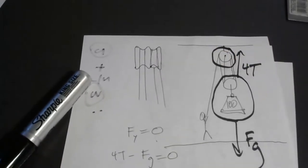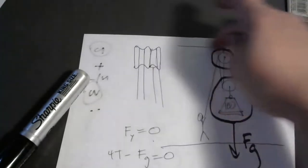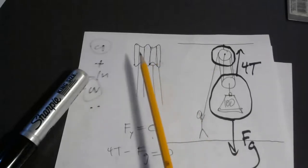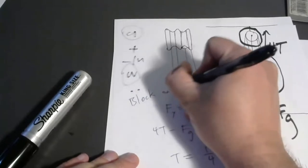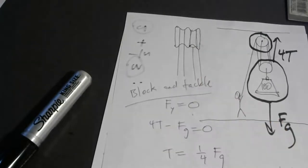If you just step back and take a bird's eye view of the whole problem — what's pulling down on the ceiling? There's the 100 pound gravitational force ultimately transmitted to the ceiling, but there's also you pulling down with an extra 25 pounds. So you can't just lift anything you want by using more and more turns. Also, eventually you're going to get significant friction building up between the rope and the pulley. If you go to Wikipedia and look up 'block and tackle' — that's an old sailing term for pulley systems — they have diagrams of common configurations used on ships. You tend to see no more than six turns, and friction also becomes a limiting factor.